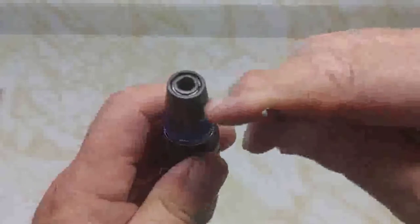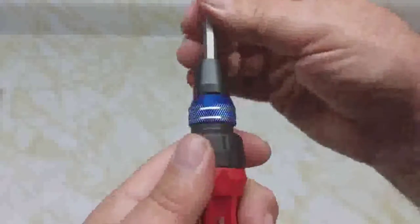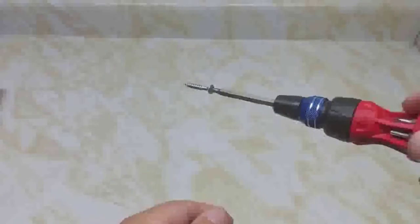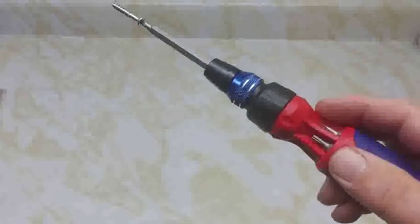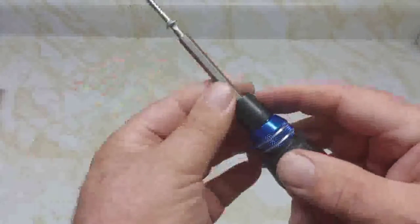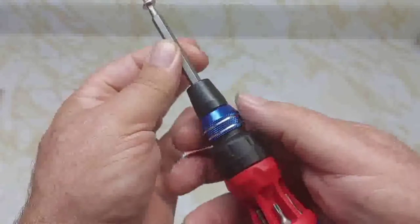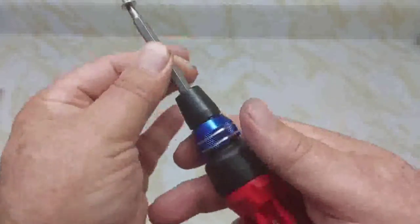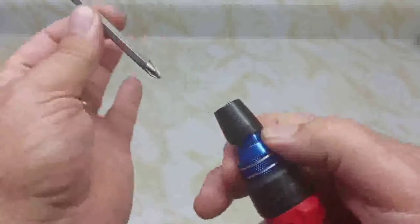You put it in the chamber here — this part is magnetic. It's locked in there; there are apparently three ball bearings that secure it. The magnet's not inside the handle, it's on the bit end. So if you want to remove the bit, just pull the blue collar back and you release the bit. Very easy — pull back on the blue collar and release.